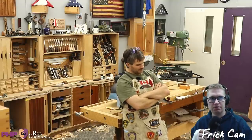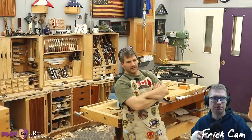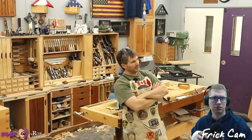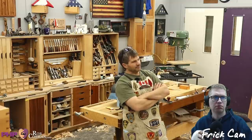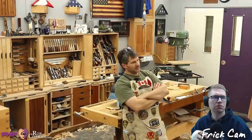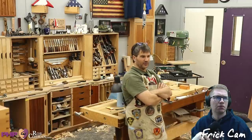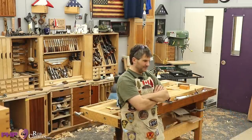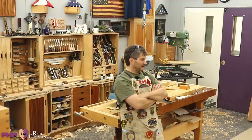This question comes from Dan in Jefferson, New Jersey. He says, are there any plane blades or chisels that you don't put a micro bevel on? No plane blades that I can think of, and no chisels that I can think of. I even put a micro bevel on my cabinet scraper and my card scraper. Figure that one out.